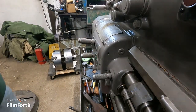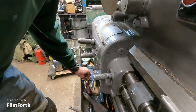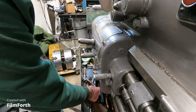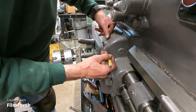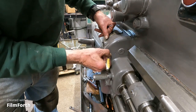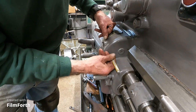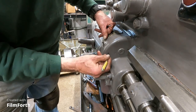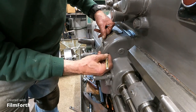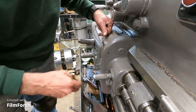Hey, I think that machine tools look better without the bolts painted. And I'll show you how I fix that and how I clean the bolts off. First, I'll take a little knife here and just score the edges where it's painted over so it doesn't pull paint off the face of the part here. Just a little bit here. I think I got around there pretty good.